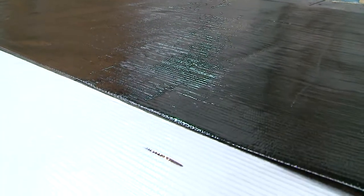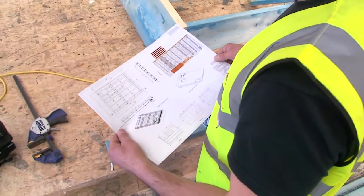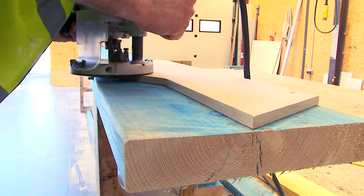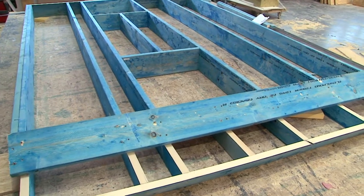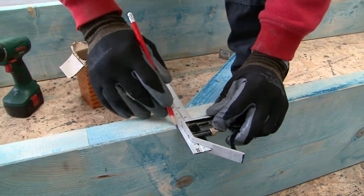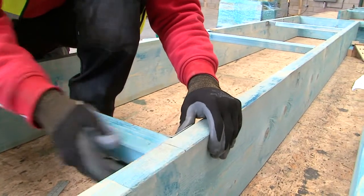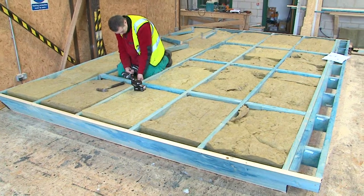The application of a self-adhesive vapour barrier further prevents air leakage whilst maintaining exceptionally high levels of vapour resistance. The flexibility of the InSolShell design enables the cassette panels to be detailed in an almost limitless fashion. The use of such advanced materials allows InSolShell to be considered for use as full-height cassette panels, limited solely by aesthetics and some structural design.